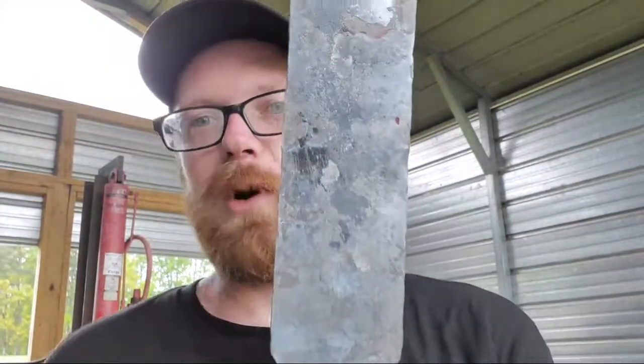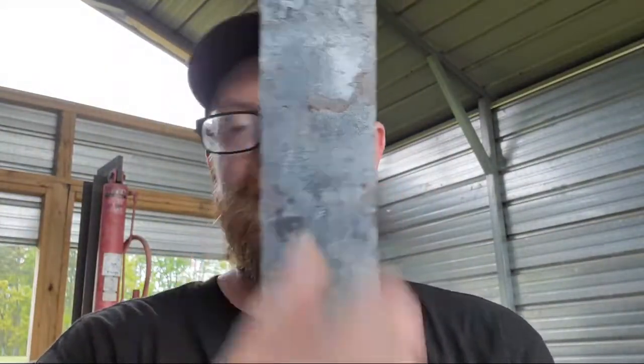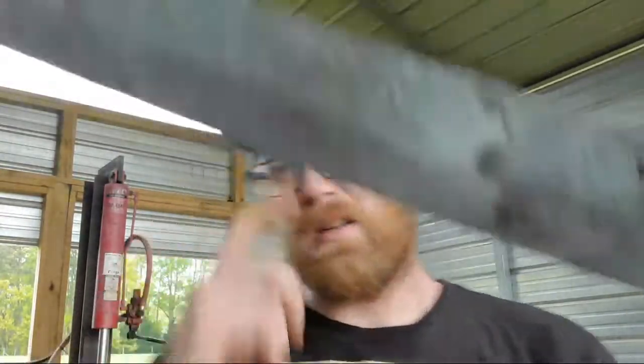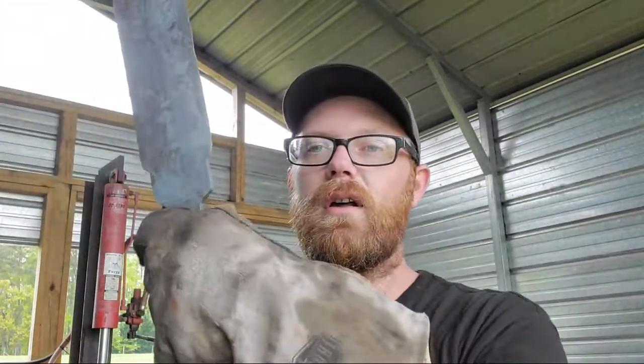I'm probably going to take 3/4 inch off the width or so. That's going to make my bevels thicker, which means with the proper bevel geometry I'll probably be able to get that hammer mark out once I pull my bevels all the way up to the medial ridge. As far as forging, that's as far as I'm going. The rest can be dealt with on the grinder. And if it comes down to needing to put a fuller in it, I've got everything I need to do that.